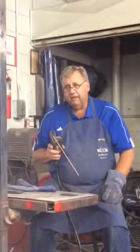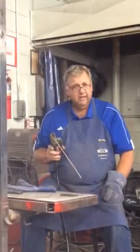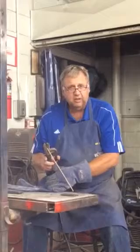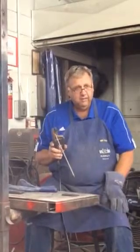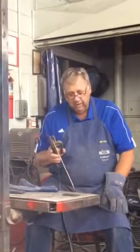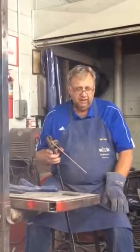I had an old welder here in town when I was young, and he was watching me do some welding. He said, "Don't worry about weaving at all. You're probably going to be shaky enough to supply enough of a weave pattern until you get used to it." So he said keep the tip right in the puddle, almost like running a stringer. That would be a stringer bead. The weld puddle itself will get large enough, and it will bind the two metals together.